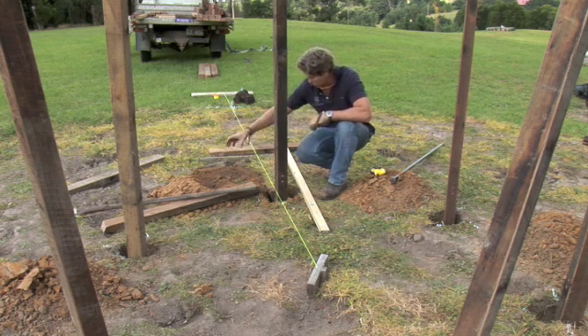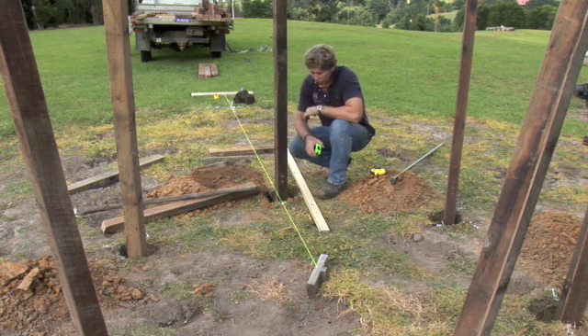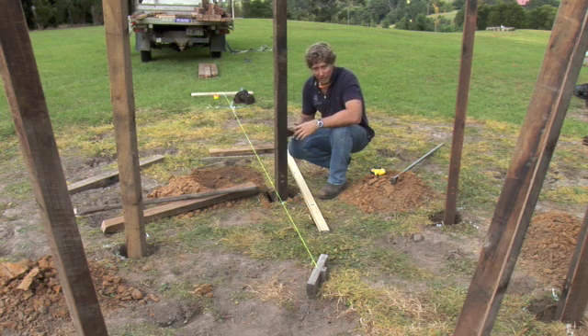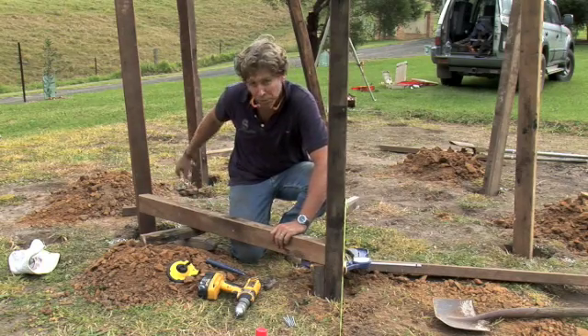I'm now going to put some more of the soil that I've dug out back in around the post, keep checking that it's in the right position, and firm this post up so that it's nice and rigid. You could, if you wanted to, concrete your posts in. I tend not to, because that concrete once it sets around the post forms a spot for the moisture to sit in, and that actually makes the post rot out a bit quicker. So normally I just put the post back into the soil and thump the soil down around them with the back end of a crowbar or a heavy piece of timber — that's more than adequate for this structure. The next process is to start putting the bottom trimmers round, and they're going to hold each post in place as we go.